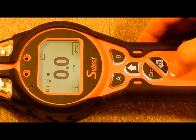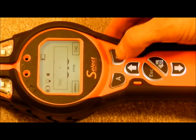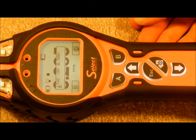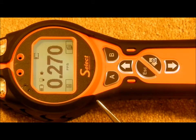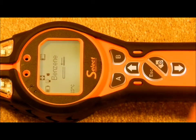The most important soft key menu for the Tiger Select is the TAC, or Total Aromatic Hydrocarbons, and Benzene mode. Use the down arrows to locate this menu. In TAC mode, the unit uses a response factor of 0.5, which is close to that of similar aromatics like benzene, toluene, and xylene, and reads in sub-ppm levels down to 1 ppb resolution. Return to the benzene mode — if a benzene measurement is desired, use the A soft key. The unit tells you to insert a tube, indicating that it's ready for benzene measurements.